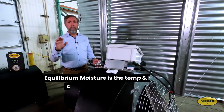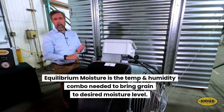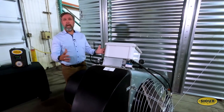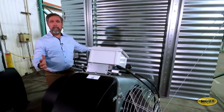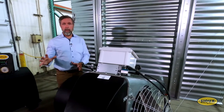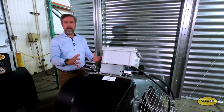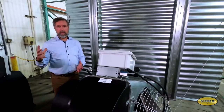Let's take a deeper dive into the EQM heater, because this is kind of where the new magic begins for drying. Equilibrium moisture is basically that moisture that dries a specific grain — rice, soybeans, corn. Let's take corn for example — to the desired result, like 14 and a half points. That means the bin is at 14 and a half, and when you set this you let it go and it dries the product in the grain bin to that desired level. No more overages or underages at the elevator — you don't have to worry about getting docked.